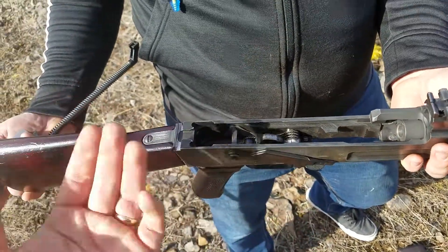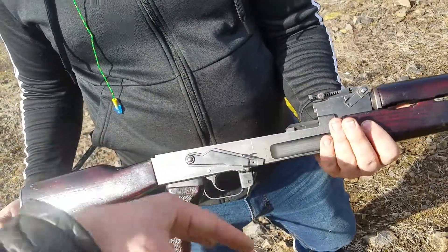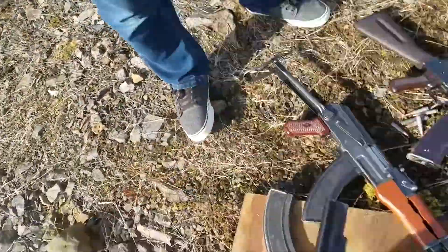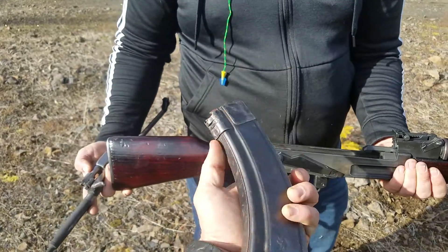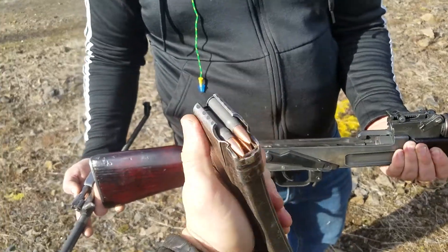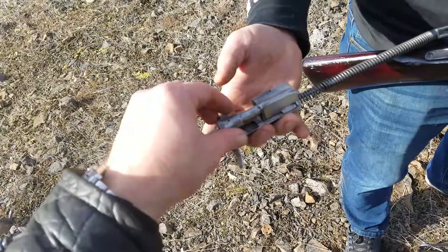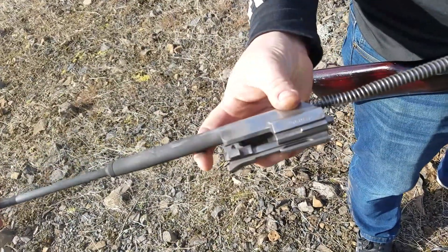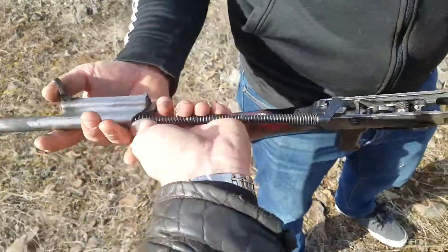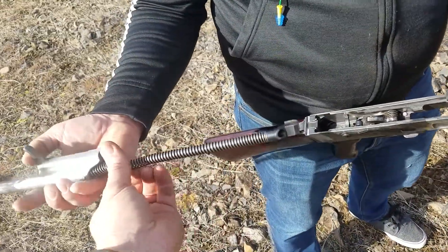Double hook trigger, the ejector — everything's milled into this receiver and then put on. The safety is very stamped, heavy gauge steel, and so is the cover. This is a Russian slab-side magazine; I brought that from Afghanistan. The original AK-47 magazines were slab sides — big, not stamped, didn't have as many ribs, thicker gauge metal. The bolt doesn't have lightning cutouts on it — it's smooth on one side. The spring is not double-wound, and instead of two pieces of wire there's an actual piston. A lot of machining was involved — a lot of effort went into these. These were severely overbuilt.